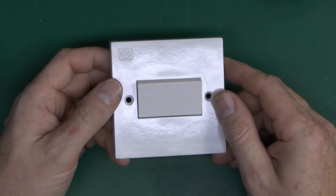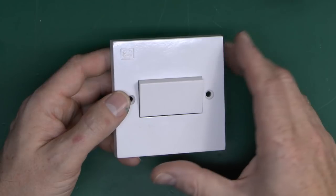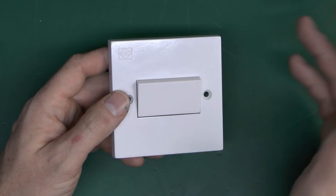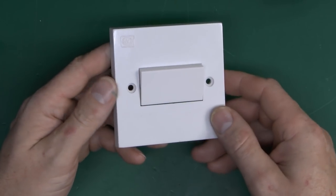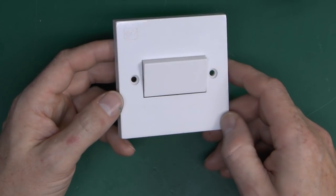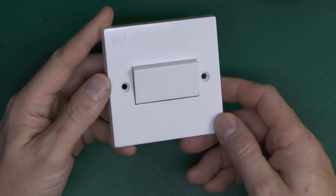Now, you may have already guessed what this switch is, but let's have a closer look at the back and see if your guess was actually correct. This looks like a 3-pole fan isolator, and those are used for things like bathroom extractors where you have your line, switch line, and neutral — so 3 in at the top, 3 out at the bottom. These normally get stuck above the bathroom door or somewhere else inaccessible, and that's what basically this moulding is for.